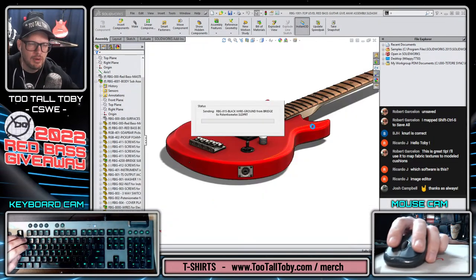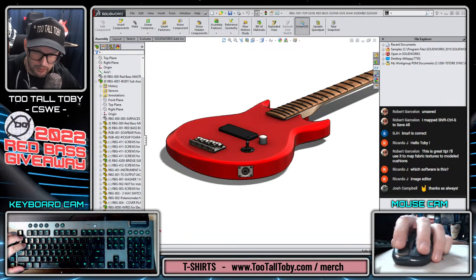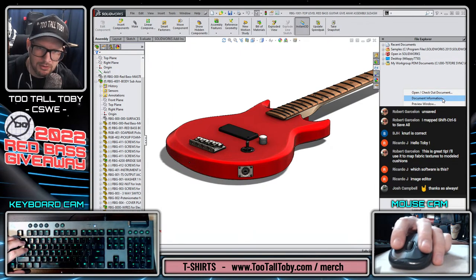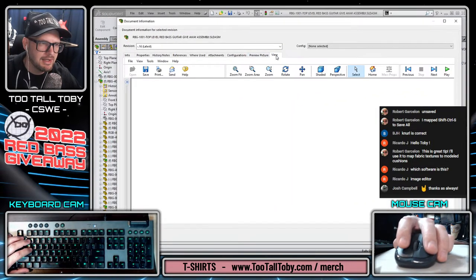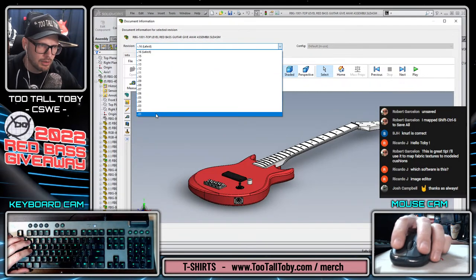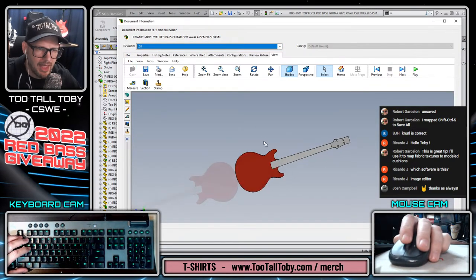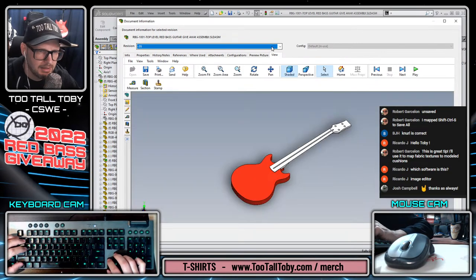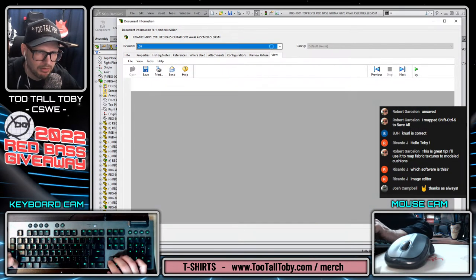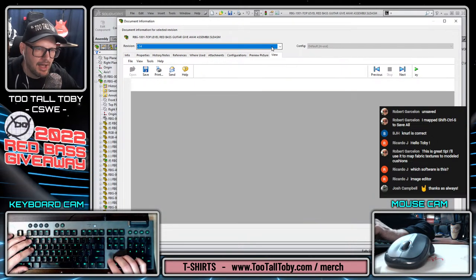Yeah. When you do have a PDM system, something else that's kind of cool is that you can do a view through eDrawings to view the actual historic record of the project. What I mean by that is if I go to any one of these files and I go to document information, I showed this before that we could take a view and look at this thing from an earlier revision. But you can also use embedded software like eDrawings to look at this thing from an earlier revision. That gives you the ability to measure and to look at the thing in 3D and discuss it if you're doing a design review with somebody, if you wanted to talk about what the evolution of this project was. Being able to do so in eDrawings is quite powerful, quite beneficial as well. So just another benefit of a PDM system.